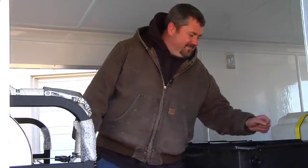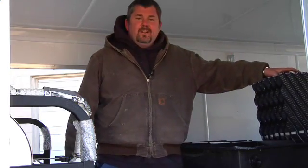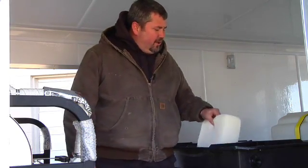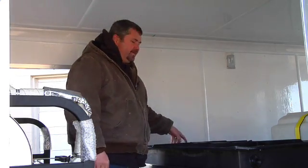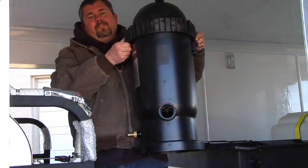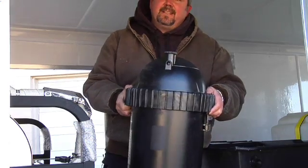Inside the trailer directly behind the machine is our wash water recycling system. The first chamber has oil-water coalescing plates, and each additional chamber has foam — as it goes through, the foam comes in from the bottom, rises over and drops through, passing through each chamber and then through a polishing filter. We run it through three 95 square foot cartridge filters, and then it goes back into the 335 gallon tank for reuse.